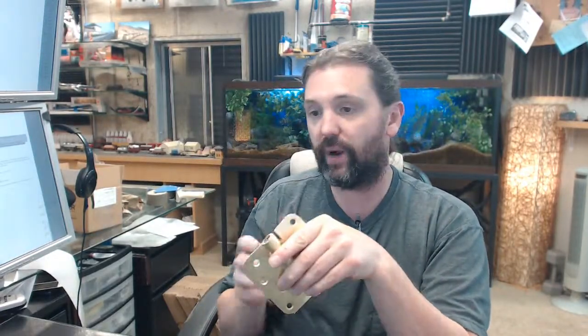I'm not a fan of spring hinges to close doors. I think that they should be hydraulically controlled with either surface closers overhead or even floor closers. However, that's just not realistic in lots of applications. It's unrealistic to have a surface-mounted closer on an application that might be a condo entry door. There may be simply nowhere to install it. Spring hinges have their place, but allowing them to do the job they were intended for is best when you are for sure following the guidelines of the weight rating of the material. Sure, you can always add more, there's no question.